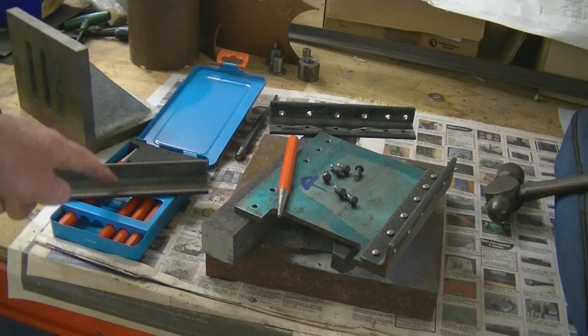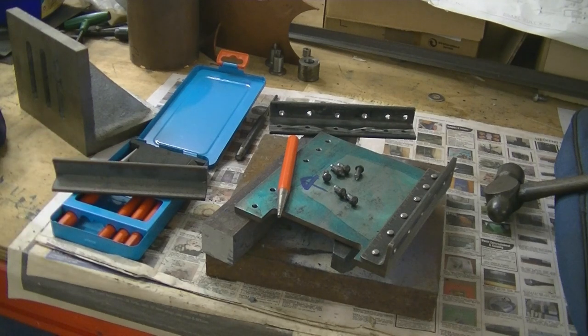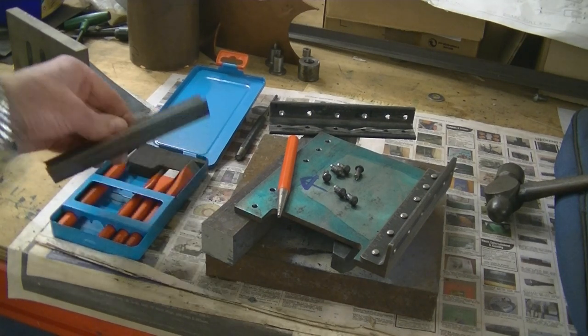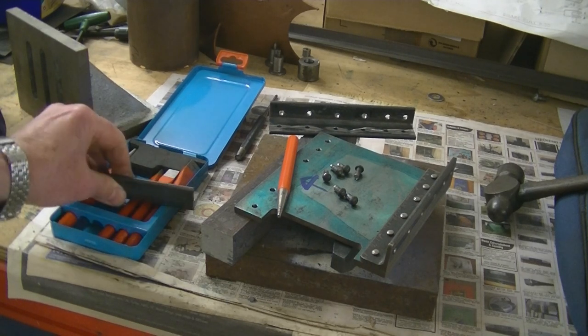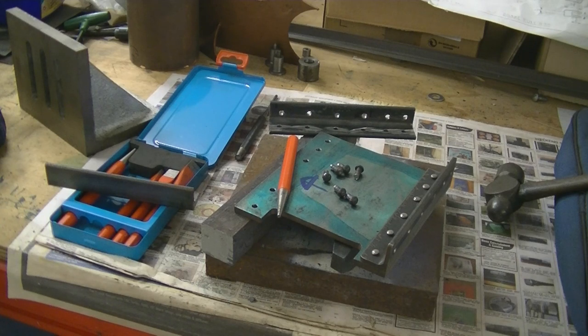Here we have a raw piece of angle. I'll square that up in a shaper after I file the end square, and I try and get rid of the wiggly wobblies. Usually with these you have one reasonably flat side and one side completely out, but I'll put the square on and find out if I have to take much off to get it to sit flat and square. Once it's suitable for use, we'll put the plate and the spreader and the angle up into the loco, and then transfer punch the new sides. Back when we're up to that.